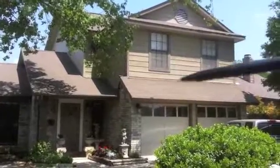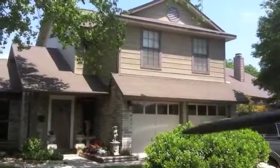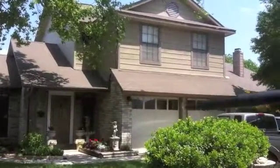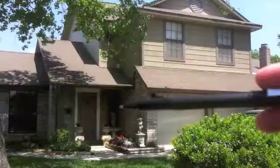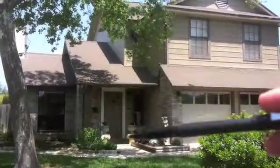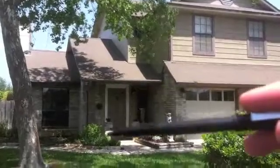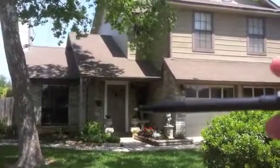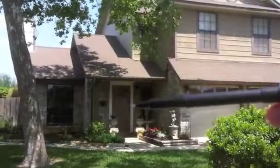But then we're going to paint all this siding, all the siding around the garage doors too. Do a garage overlay with Hardie plank, paint the garage doors. Come on over here and send me a picture of what you want around the front door, and we'll build that as far as a lintel and the casing, fluted in composite. Probably end up being like an AZEK composite molding.